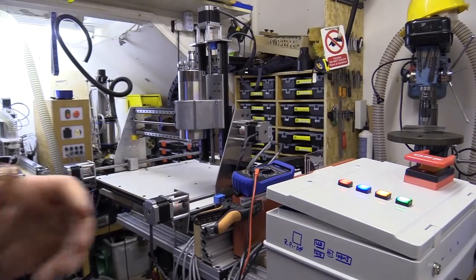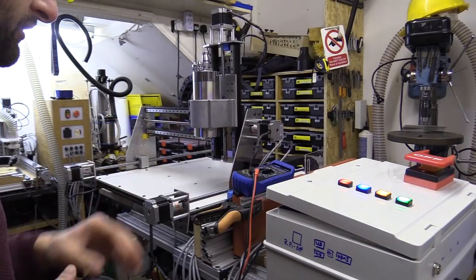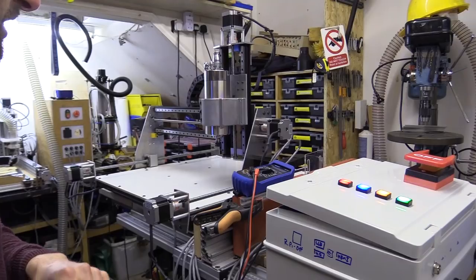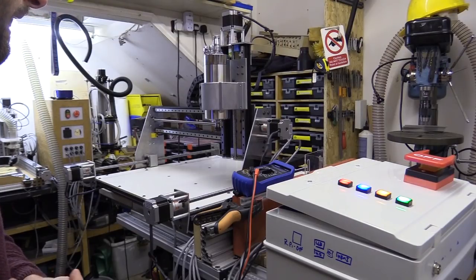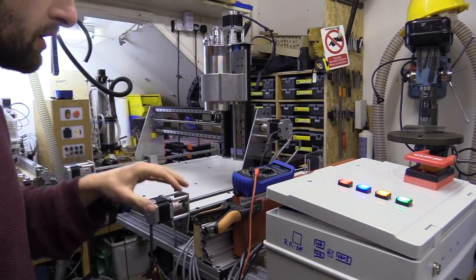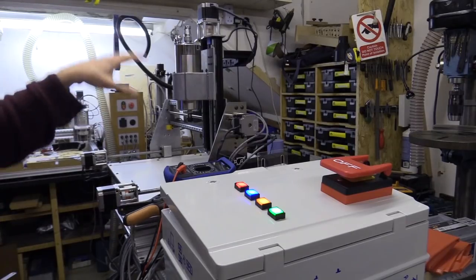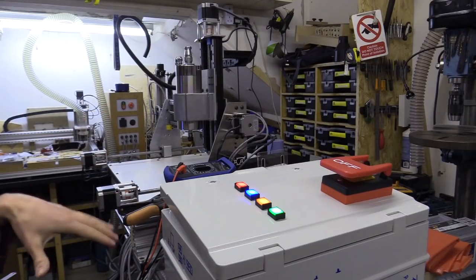I can now show you all the buttons working while performing a test movement from a G-code file. I'm going to start by pressing the hold feed button. That stops the machine and slowly moves the Z axis up to a safe parking position. If you imagine this was a door that was open, that's the last action that would occur. When the door is closed you then press the cycle resume — the green button — which brings the spindle down and there will be a dwell for a few seconds while the spindle turns on, then it plunges down and carries on.